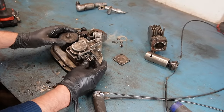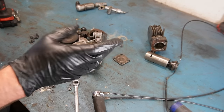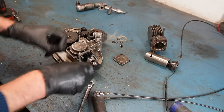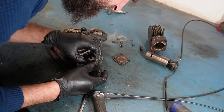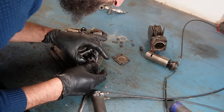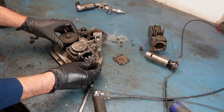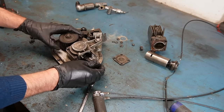This is the piston, and I'm very surprised to see two rings on this because everywhere I look I'm told that this engine is supposed to have three piston rings. But both of the engines that I currently have in my garage have two rings. These rings cost me 25 euros per ring last time I had to order one. These seem to be alright, so I hope I don't have to buy new ones. It is moving really freely and nicely — that's also very nice.